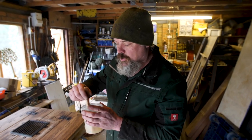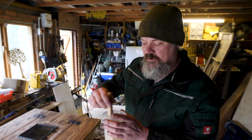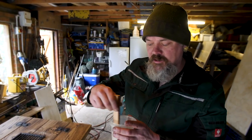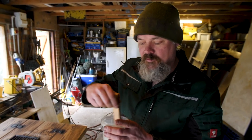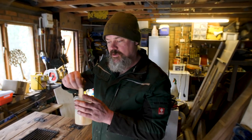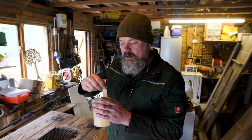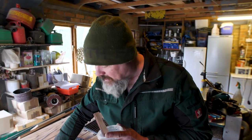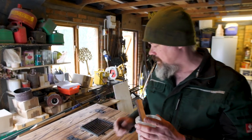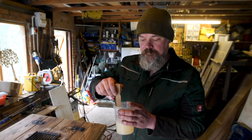So this is essentially, it'll look like a finish, but it's very dry. I think it'll suit a front door really well. And it's harder wearing than the catalysed lacquers. So it's kind of resin based, so it kind of gets into all the nooks and crannies and seals. I've been quite generous over the butterfly ties, because this will kind of seep into all those gaps and almost glue the butterfly ties in place, as well as kind of paint, as well as protect the timber.